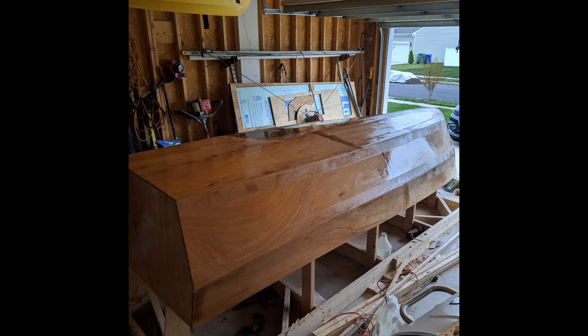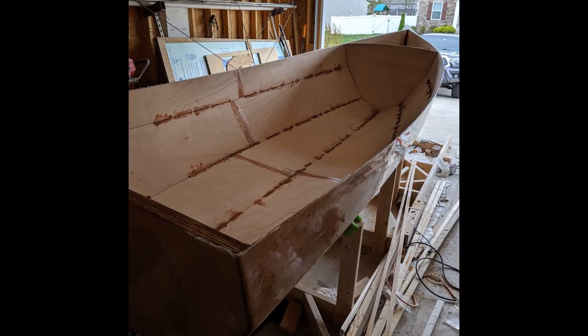As for the shell outside, just run regular fiberglass. It doesn't need to be anything special, just not chop strand. Make sure it's a big flat matte of fiberglass. Now there's other vendors, I could tell you who I used, but I don't think it's pertinent to this because they all do the same function. As long as it's a marine grade epoxy resin that's meant to adhere to wood. Like I said, a lot of different brands, a lot of different places you can buy it.